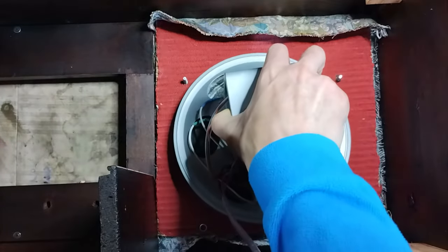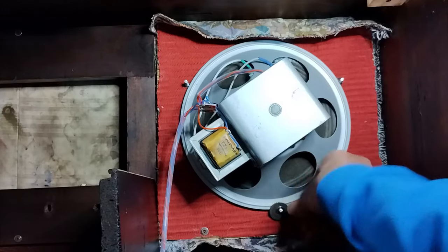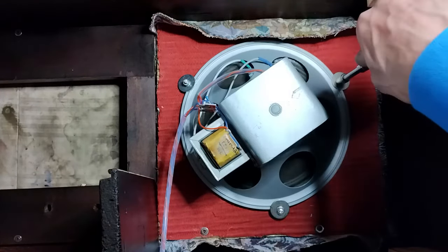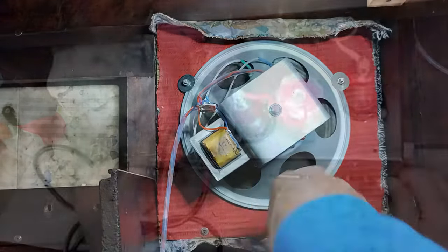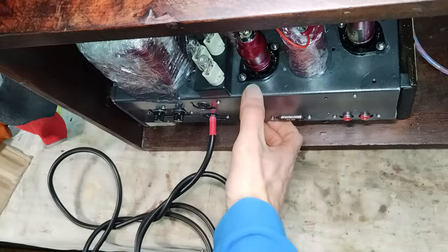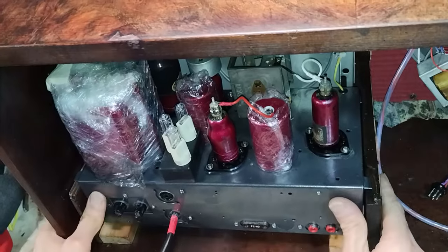These clips show the process of putting back in the cabinet the loudspeaker and the chassis. However, the chassis and the loudspeaker went in and out of the cabinet several times because it was necessary to work again on the chassis to fix the issues that continued to emerge for quite a while. Later, the connections around the loudspeaker will be insulated, considering that they carry high voltage. It is possible to notice that the antenna connection was replaced with simple plugs, but later they will also be replaced using longer ones for making them accessible from outside the back panel.